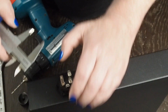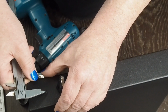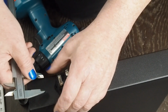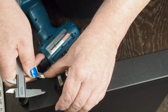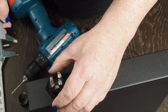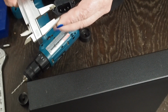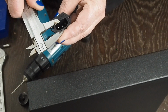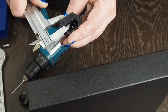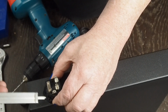It's just a little below center. I'm going to go ahead and go down to like 22 millimeters. Let's say 23. And just see what that's going to look like. I mean, that should be good. I'm pretty sure these holes are halfway across. Yep. So these holes are the midpoint vertically.